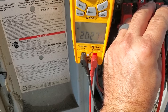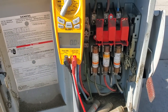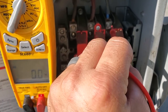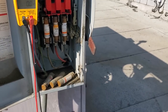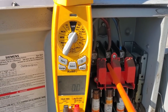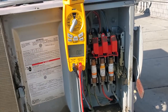This is what I'm talking about when I say we have dirty power — we have low voltage issues for sure. We've got three-phase power coming in. Another thing I'm noticing is things seem loose in here inside the disconnect switch. I'm going to try to torque down on those connections. Nope — they don't tighten. So we've got to figure out why the fuse blew.